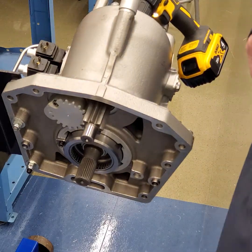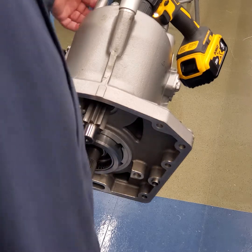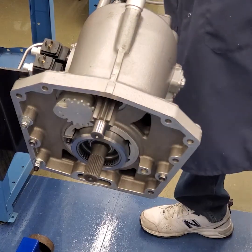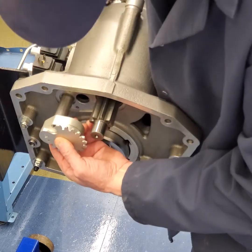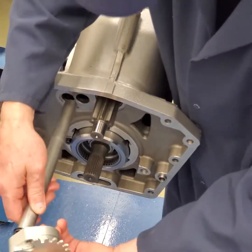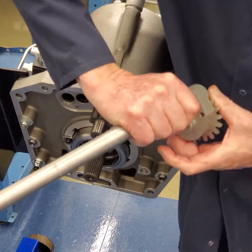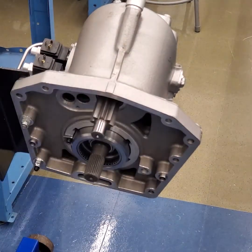I'll pull those two bolts out and take that resolver out next. Pull that bolt out, spin it around, and take the other bolt out so I can pull the resolver out. The resolver is going to come down through this tube with the harness — the harness work up here has to snake down that tube. Once the two bolts are out, slide it out and hold it together when you take it out because you don't want to let it come apart. I usually take it out with the tube, and I'm going to put two tie wraps through the bolt holes to tie it together so it can't fall apart, then put it off to the side.